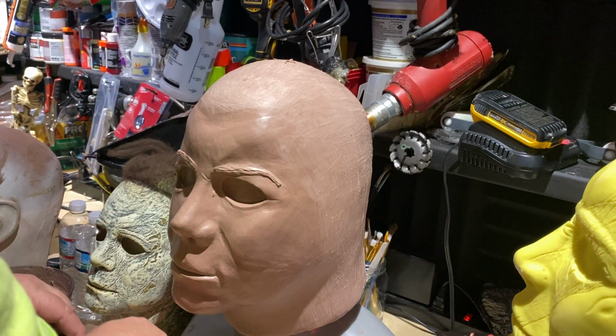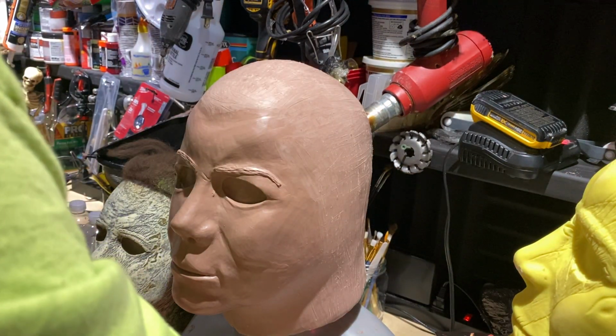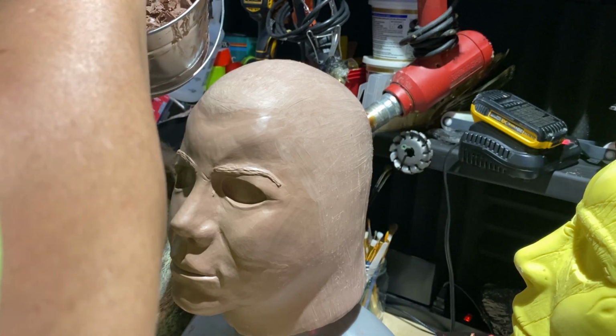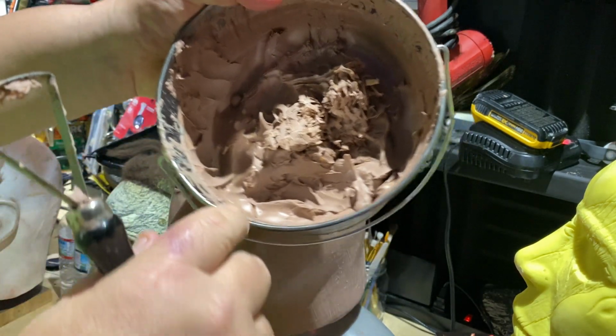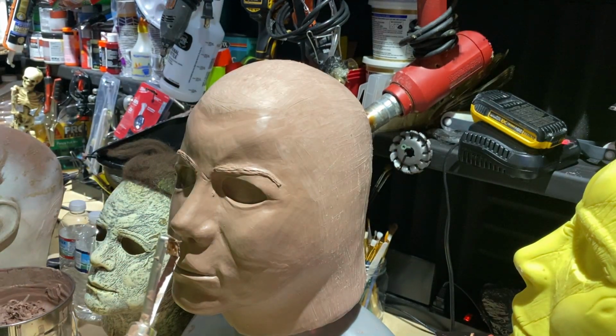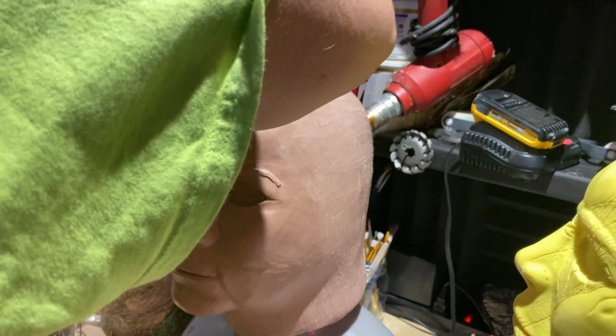And then once I get all that done, I rub this thing down with naphtha. This is a plastine clay, and naphtha really cleans it, or smooths it out really nice. I guess it's got a plastic in the clay. It's weird when you see the clay in the pot when you're melting it. All the plastine kind of bubbles up to the surface, and it ends up being real yellow. You'll see yellow all over the surface of the clay before you stir it up. And you have to stir it to reestablish that plastine back into the clay.